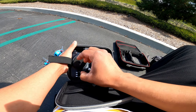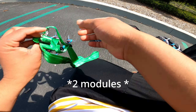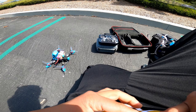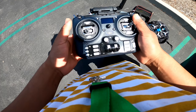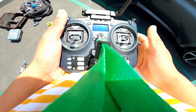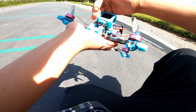I'm not using the DJI radio anymore, so I put this ELRS antenna and receiver on because now I'm flying with ELRS. The controller I'm flying with is the Jumper T20 ELRS Gemini. Gemini means it has two antennas or two transmitters. For it to work properly I need a diverse gemini receiver — this is just a regular receiver, so I only fly with the one antenna.